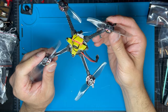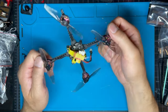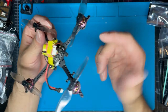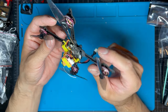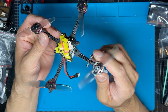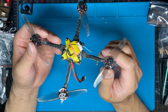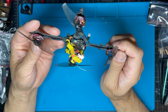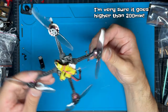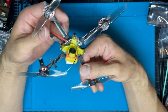Today let's talk about this Baby Tooth 3-inch 1S FPV build that I recently built. The main thing I want to talk about is the flight controller — this is a Happy Model Diamond F4 flight controller all-in-one, so it comes with the FrSky SPI receiver, ESC, flight controller, and VTX. The VTX is power-switchable between 25 and 200 milliwatts, which I like, and it's really light.